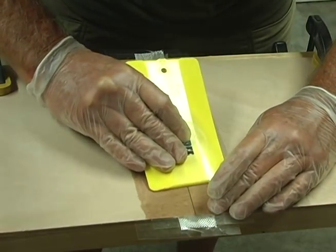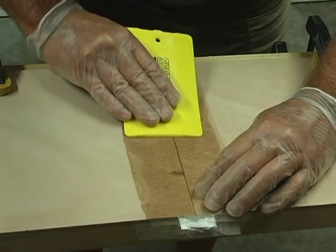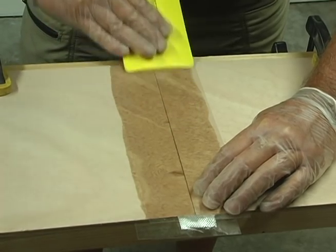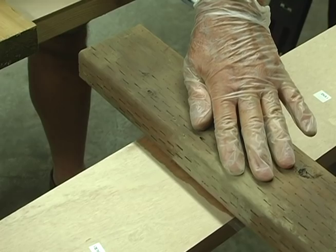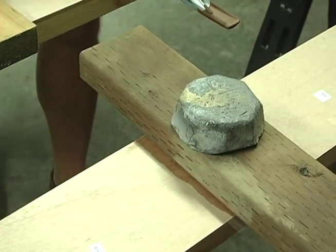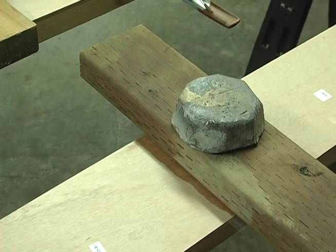Cut a piece of 3 and a half inches wide flat scrap plywood — a flat piece of 2 by 4 will also do. Make sure the scrap wood is not larger than the mylar, and place it on top of the mylar and glass tape and weight it down with a couple of bricks. This will ensure that the panel ends forming the seam are pushed flat against the floor and that the fiberglass tape and epoxy are flattened out into a smooth seam.